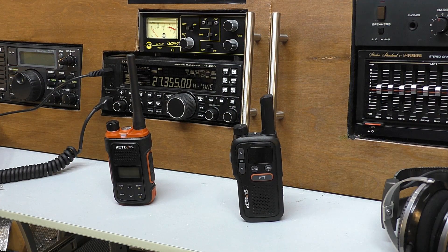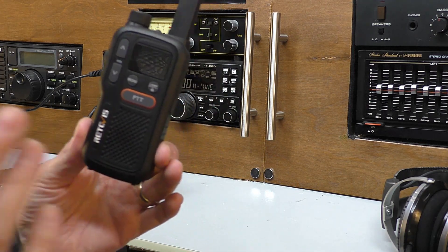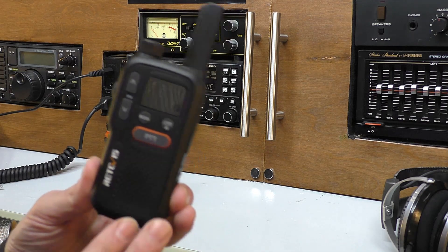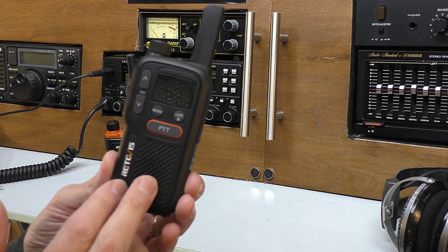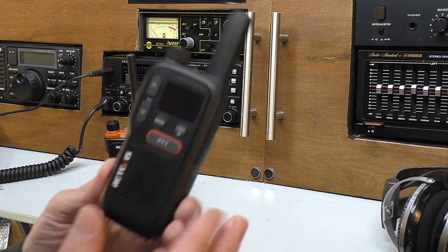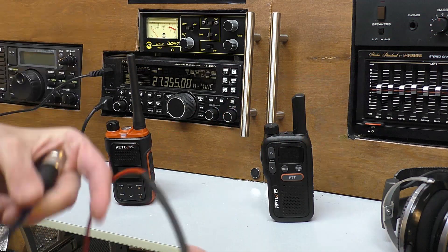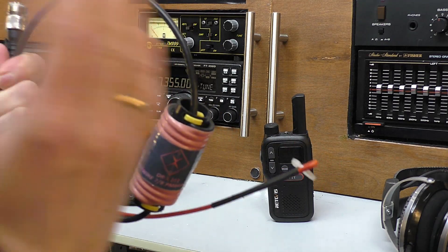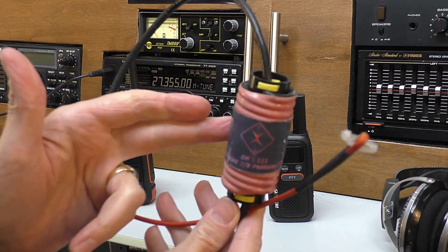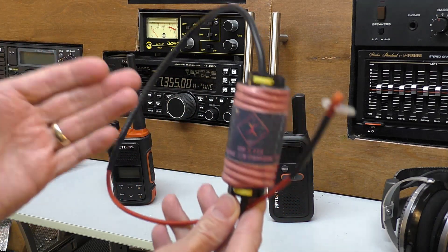Conclusion time. I think it's pretty much what I thought, and it's a bit like last time. The FM carrier signal from this little half-watt radio really was picked up nicely by that 18-foot Antron 99 CB antenna — it is up really, really high on the side of the house. The audio was quiet, and I just think that's because this is on 446 megahertz and it's not resonating the antenna enough to really pick up the audio properly.